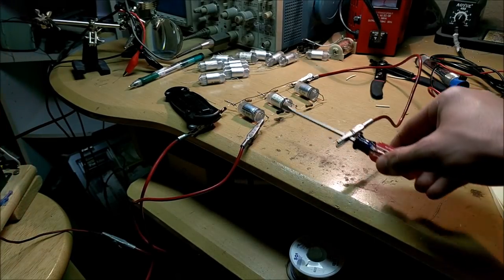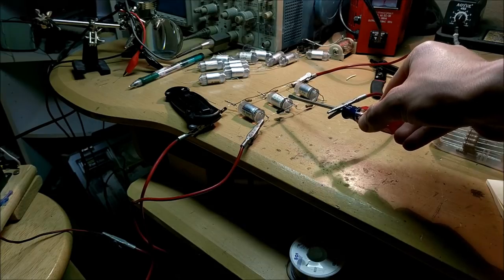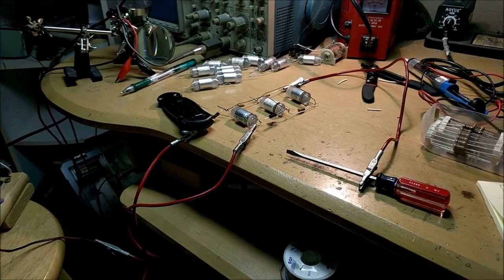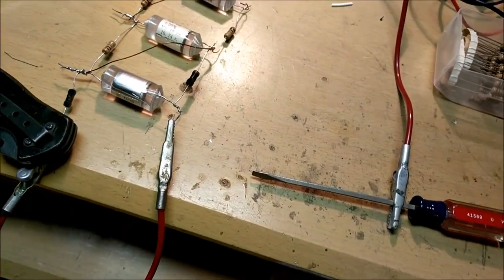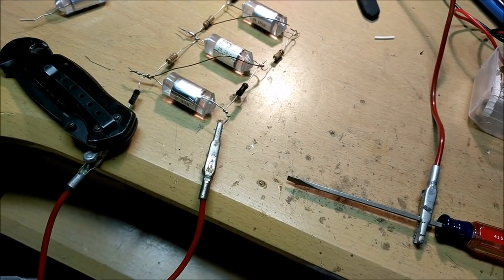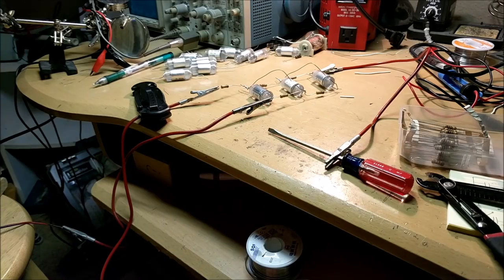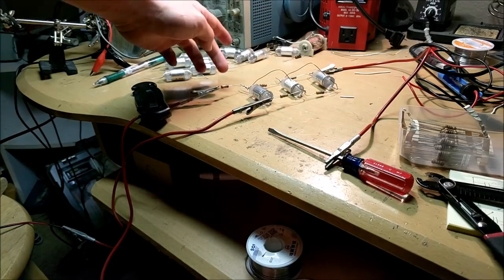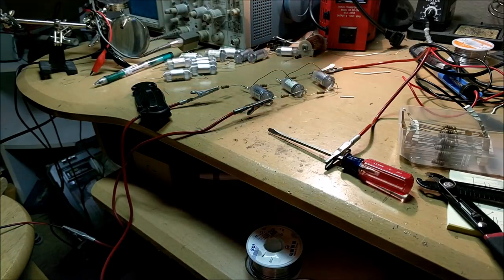Oh, that is not good. Oops, well, it looks like I burnt up some resistors. I think my spark gaps are too close together. Gotta fix that. All right, I'm gonna give this Marx generator another run. I expanded the spark gap and I replaced all the capacitors that caught fire.